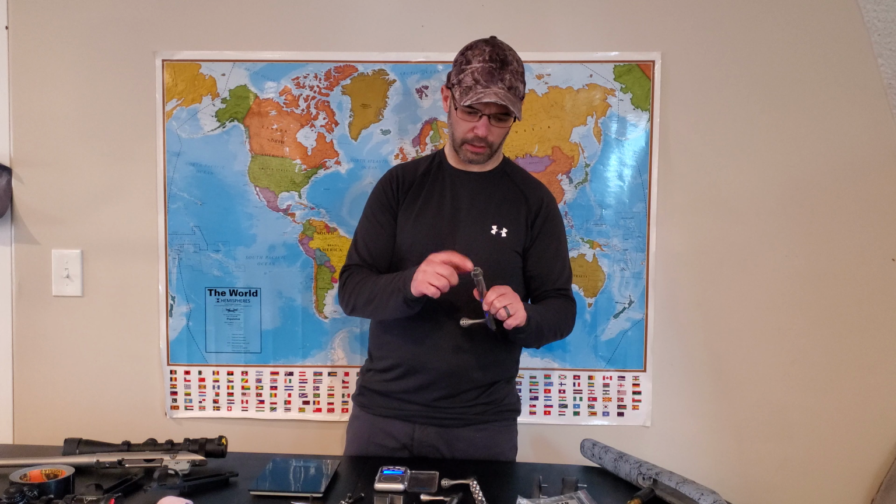Then you've got this fluting work. This fluting work is something you'd have to have custom done by a gunsmith that knows how to do it. This particular fluting pattern is called the X pattern from a company called LRI. Typically you'll see something more like this spiral fluting, which isn't going to take off quite as much weight. Just comparing these two, you've got 7.5 ounces versus 8.6 ounces. So a 1.1 ounce difference between these two fluting designs, everything else being equal between those two bolts.